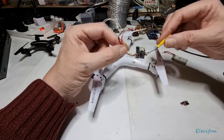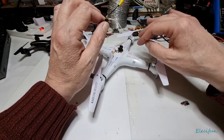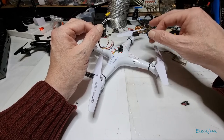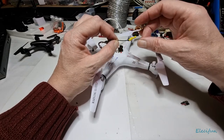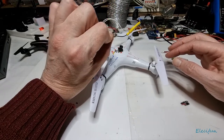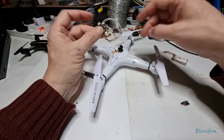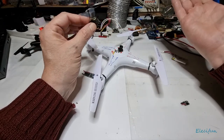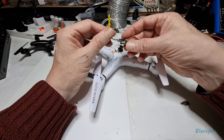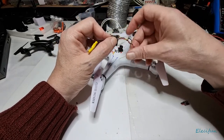This little camera here — it's broken but it still works. It's on about 25 milliwatts, which is great for just flying around here. I can fly around the building and back in and out with 25mW. It may not be as clear as Wi-Fi doing the same around the same building, but it's definitely a quicker image — when you turn, it's a lot quicker. There might be a slight bit of a gap but you can work with it. I'm in my mid-50s, so maybe I'm not keen-sighted enough, but I do prefer analog. I do like the look of those expensive FPV wireless ones doing 10-12 kilometres — very good.